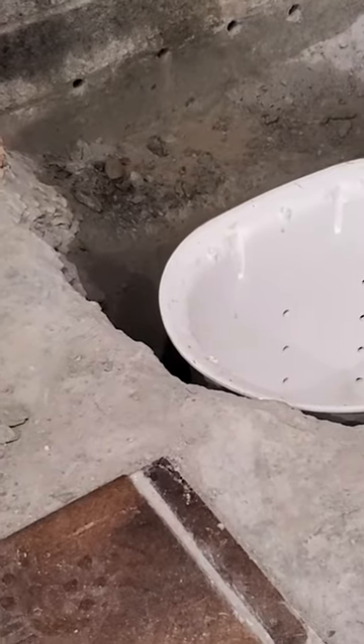Over there on the other side we did a smart sump and we did a partial system. The reason is because they didn't want to remove all the tile in their basement and completely redo it, so we saved some tile because there's a walkout section of the basement where most of the time water is not going to be coming in. It's a low risk area, so it wasn't worth it to the customer to remove the tiles for something that may never get water in it. So as a result we did a small waterproofing system over there, led to a smart sump.